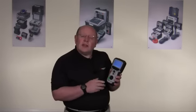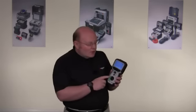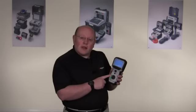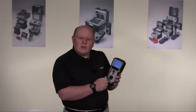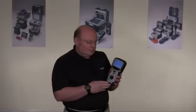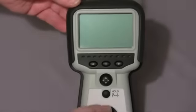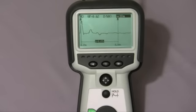The third thing you typically need on a TDR is gain, and auto sets up the gain for you as well. So the auto setting on the TDR1000-3 is a simple one-selection option for those of us who don't do TDR measurements all day long. The auto feature enables us to connect and detect a cable automatically.